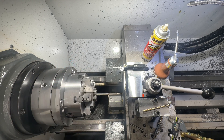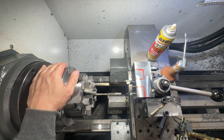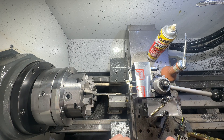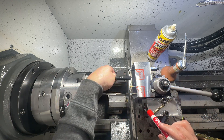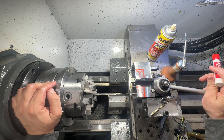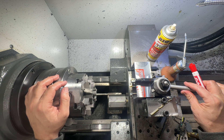Next thing we're going to do is ream out the chamber reamer hole so every tool is perfectly on the center line with the spindle of the lathe. Then we're going to come in and cut these slots out — that's going to give us rigidity for our small tools. We'll chop this section off and move it over so all our tools are bolted directly to the gang tool bar, making them extremely rigid so when we cut we shouldn't get any vibration.